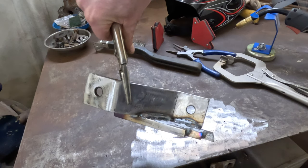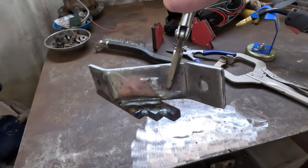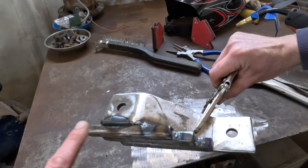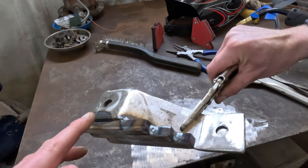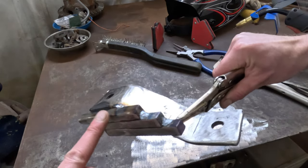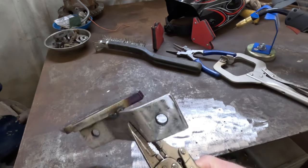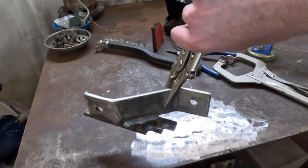Here's where we're at so far — three bottom pieces welded to the side bracket. I ran a couple of beads down each side. Now if you notice, I did step this back from the edge — the inside of those frame rails in the corner are actually rounded, so if you put this right to that edge it would have had a square corner meeting a round corner and wouldn't have sat right. So I stepped that back a little bit and rounded this edge off so it makes up for that contour on the inside. We'll get that set in place and figure out the rest of the bracket.